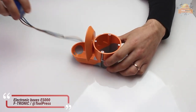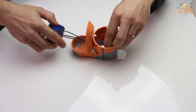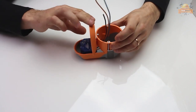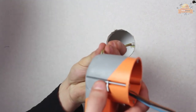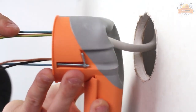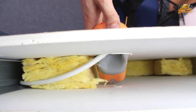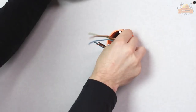The Electronics Box E5000 from Eftronic is a socket box with an additional connection chamber that can be used with all common relays and actuators. It saves up to 70% assembly time and ensures problem-free compliance with the bending radius for network cabling. Tool-free insertion uses 2K membrane technology. The socket is one-hole mounting and the hole diameter is 68 millimeters.